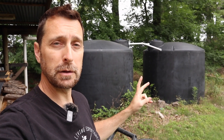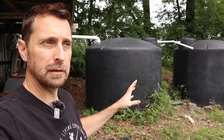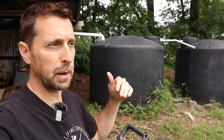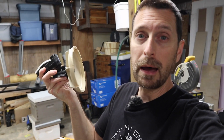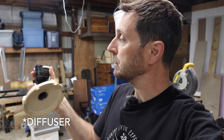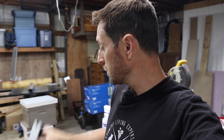These two tanks have about 5,000 gallons of water in them — they're full. I've only opened the valve slightly to let pressure in and prime the pump. I also took the valve off the top and primed the pump, and it's still blowing water out the bottom. Here's what happened to the old impeller — these are plastic impellers on a $600 pump. It just sheared right off. I had another pump, took the impeller out of that one, put it in the housing, and I just can't get it to seat correctly. This is a big challenge because I need these rainwater tanks to water my garden. Our well is salty, and that salty water is destroying our garden. The salty well is no big deal for livestock, but for vegetables it's not good.